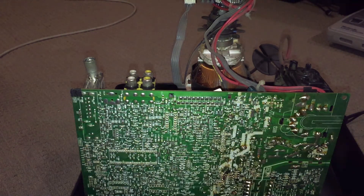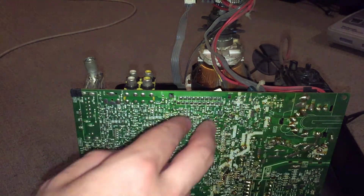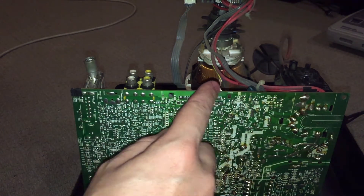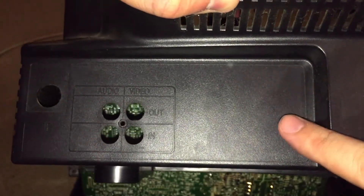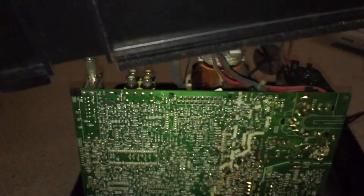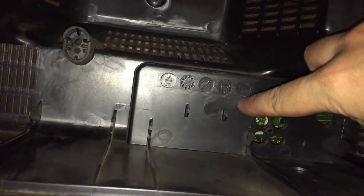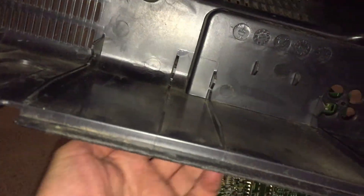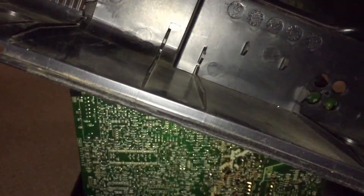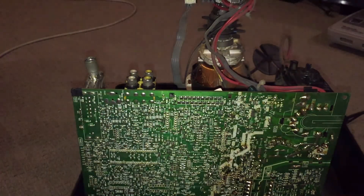You'll have audio as well, obviously. So unfortunately that's pretty much useless. We could put a panel mount connector there, but making a hole in the plastic aligned with it is going to be fairly hard. There's no marking at all on either side of where the hole should go, so I think it'd be easier to mount a female connector with some screw holes rather than panel mount it.